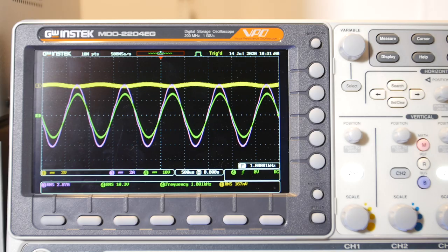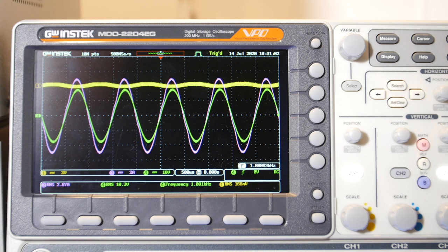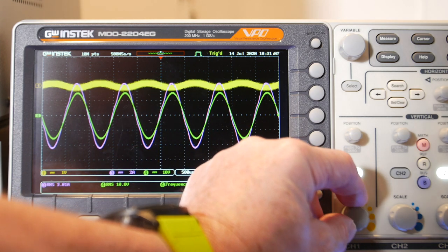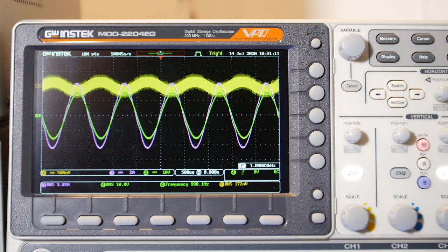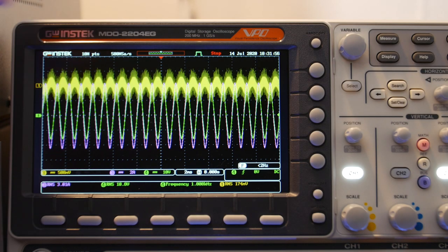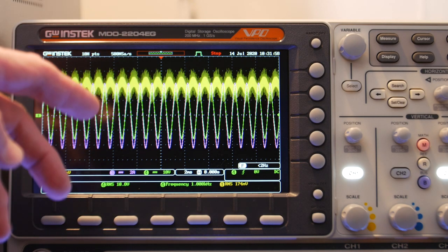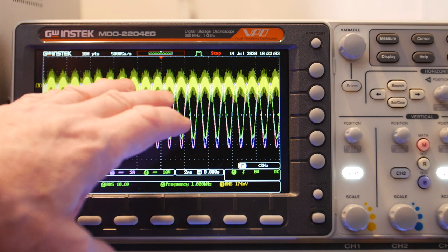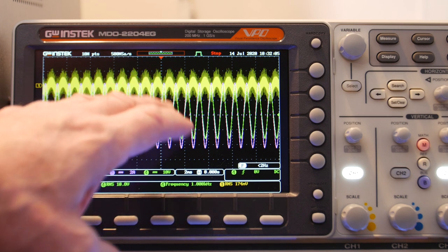Look at that — that's an interesting signal. It went through and it's got the feedback coming in. That's how we're modulating our gain signal with that feedback because now we're getting a square wave. So this is where the Class D stuff is starting to happen. It looks really noisy, but it's really just the Class D stuff modulating with our 1-kilohertz sine wave. Let's zoom in.